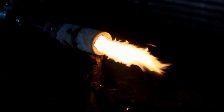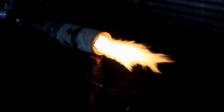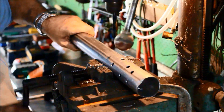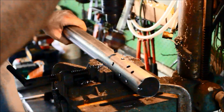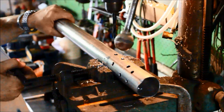It's suitable for furnaces for metal melting or heating for different things like that. It's basically one pipe with some holes in it, stuck in the end of what constitutes a larger pipe — in this case, a fire extinguisher. The internal pipe is what you can see here as I drill holes in it.